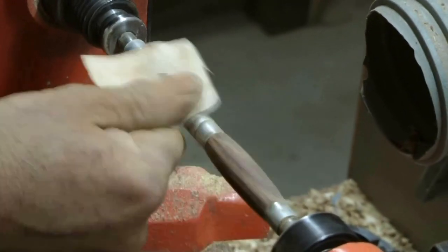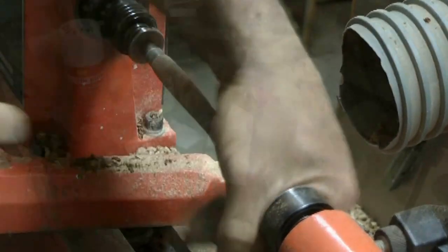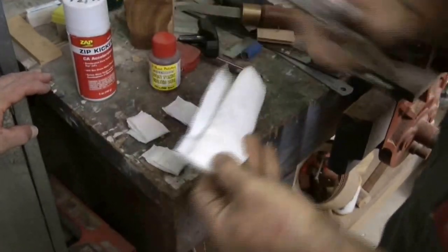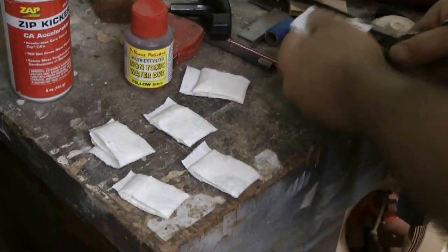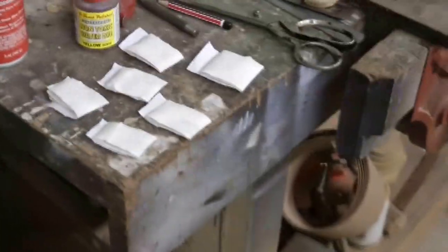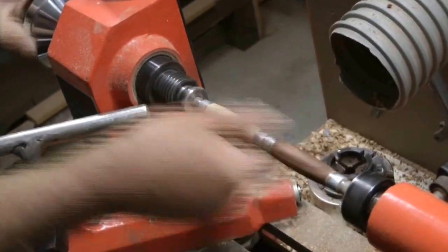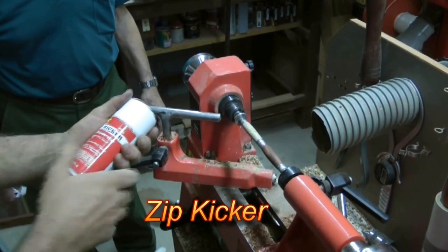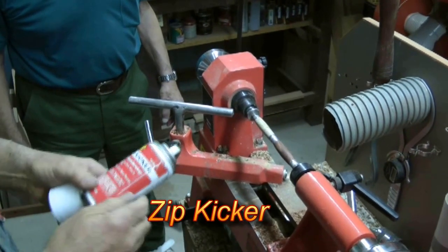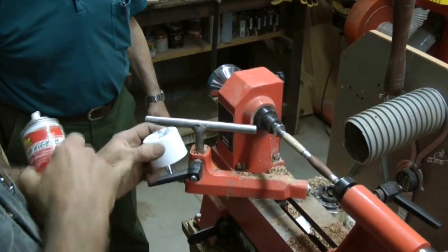Just make sure there's no scratches in it. Take the paper towel and fold it into a fairly thick wad, and I'm going to cut it into sections like this. I've only sanded them to 400 but I've got no scratches anywhere — no radial scratches. I've gone vertically up and down to get rid of them. The superglue I use is from Timber Bits in Sydney. I've also got an accelerator for the superglue — I get this from Charlie Erwin Fiberglass Resins and Sales here in Perth. It's eight or ten dollars a can, and one can lasts a long time.